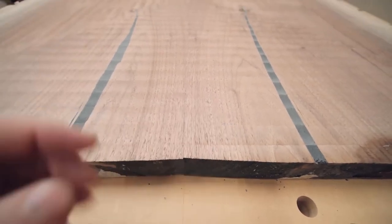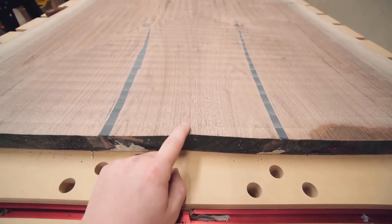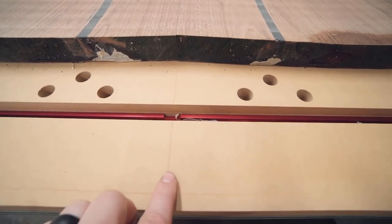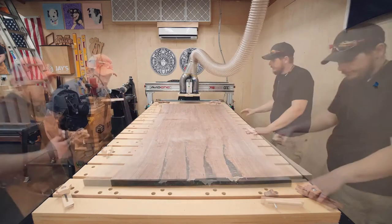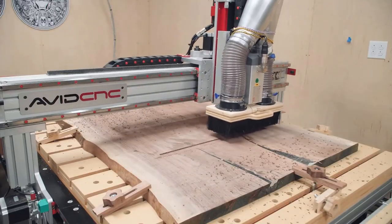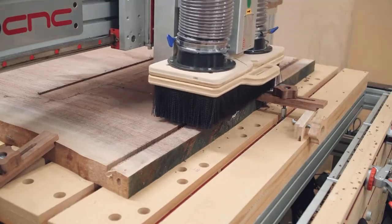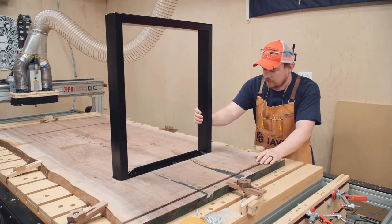You can see the center seam right there - that little tick mark. We flatten the top side as much as we need to. We're not worried about this little low spot because we're going to cut about two inches in. I scratched the center line of the machine on the machine bed, so now we can flip this over so the good, freshly flattened top side will be facing down. We line up the center seam of the joints onto the machine bed, then use the machine to cut a perfectly perpendicular cut on either side to establish our total length of 70 inches. On that same process we can also cut some shallow pockets for the legs to fit into.